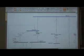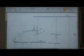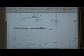Okay, well, there I am. I close that breaker. And that's the bus I'm looking at. And nothing turned red. I'm okay with the top bus. You feel happy about that. Let's go down the line and see if anything else turned red. Nothing turned red there.